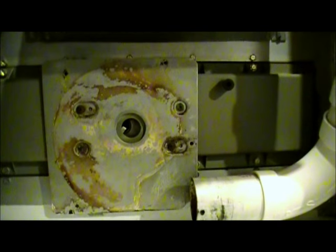That's one of the first things I wanted to show you. You can see from the back corner of the furnace the dripping. The reason why the drip was going on — we'll take you over here. If you notice this, this is where the fan sits. This fan is an exhaust fan basically designed to pull out the exhaust fumes from the chamber inside the furnace. Because it's a 90% and higher efficiency furnace, this area down in the bottom, which I've had to totally redo, was all rust. I had to clean all this up — rust all the way over to where the drain hole is, all the way back into here. This pipe here was just smothered in a bunch of tar.